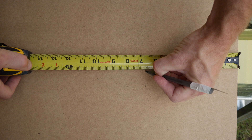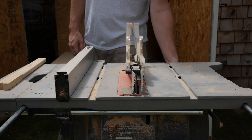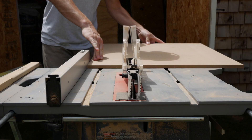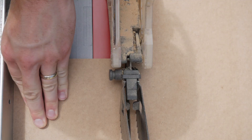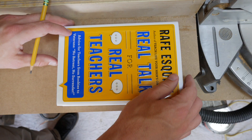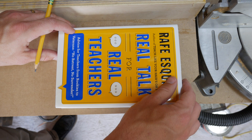I like my eyes and my ears. The books that are going on this shelf are six inches deep, so I'm going to make my shelf six and a half inches deep just to give a little bit of extra room so no books are hanging off the front. If you're lucky enough to have a table saw, you can cut these at home. I'm making three cuts at six and a half inches. If you don't have your own saw, all big box stores will cut these pieces for you. Next, you're going to measure to see how tall your shelves need to be. Place your book even with the top of the board and then make it a little bit longer than it needs to be — this just ensures that the book will be removed from the shelf easily.